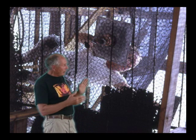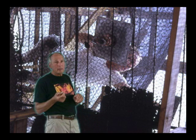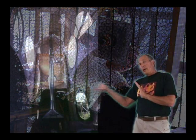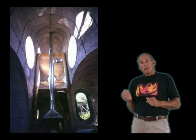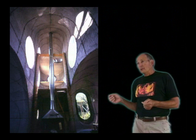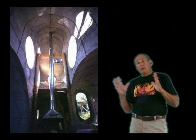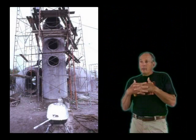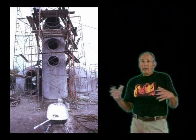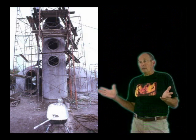The next step was the plaster — two coats of Portland cement plaster, which has very little lime in it but is very strong. You put it on the close side of the chicken wire and it travels over the outside and the inside. You wind up with an incredibly hard ferrocement shell. It doesn't have the same properties as steel-reinforced concrete — in a reinforced concrete beam, you figure tension on the bottom through the rebar and concrete only in compression. But with ferrocement, the steel and cement bond together to the point where, theoretically, you could make a ferrocement diving board. It's slightly flexible, very strong, and very durable — something that will be there for a long time.